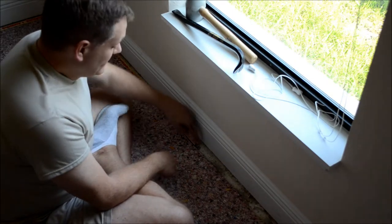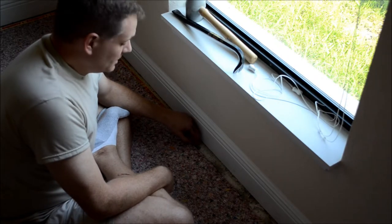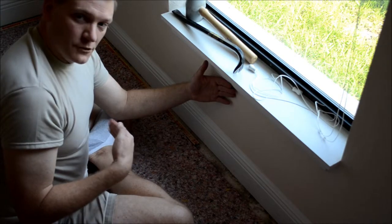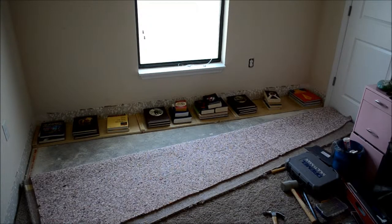The next thing I'm doing is pulling out the old tack strip because they're basically one-use — when you pull them out you can't reuse them. The bookcase itself is going to sit here off of the wall out to 14 inches as we're building this in. We've got the base plates down, currently drying with construction adhesive down to the slab. We've got some big heavy books there to hold things down and not let them slide around, making sure everything lies flat.